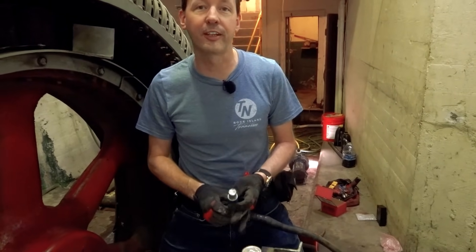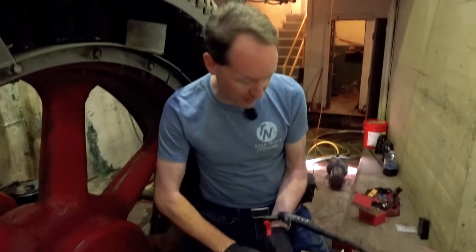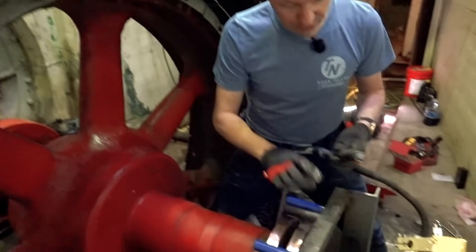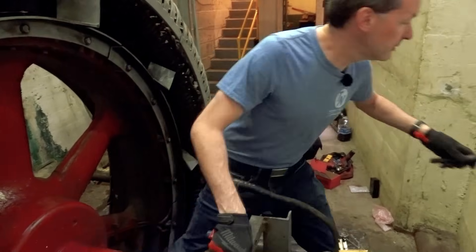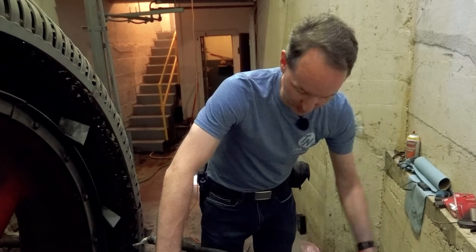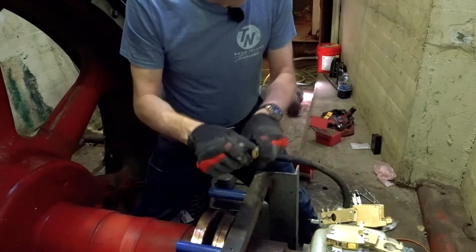Thin layers, Chris, thin layers. It sorts itself out when you stick it in the hole - it's going to clean it right up. And of all the 15 different chemicals and lubricants this antique is covered in, this is one of the nicest and cleanest ones. I'm gonna grab my service mallet - trick is to hide that because it sometimes spits. Any tool can be the right tool if you misuse it. This is my millwright's hammer. Now we're gonna set our grub screws - finger tight plus a quarter turn works in the real world too.